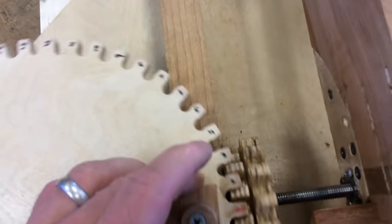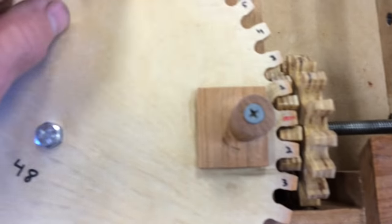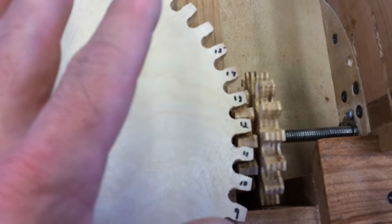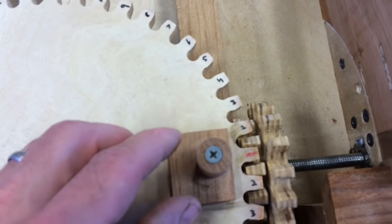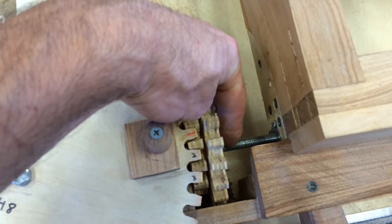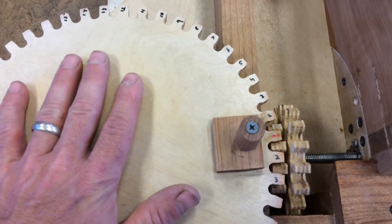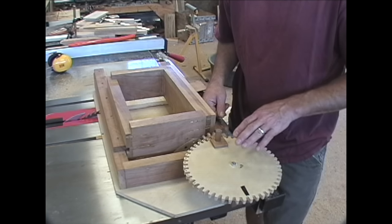If I take a 48-tooth gear and mesh it with the 12-tooth gear — you can see I've got some teeth numbered — if I go to tooth 12 here, I've turned that rod one full turn and the carriage has moved one sixteenth of an inch. That's very precise because threads have to be exact to work. If I then do a full turn on this 48-tooth gear, that rod has spun four times and moved a quarter inch. So you use the gear and however many teeth to increment how you're turning the rod.